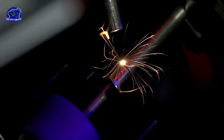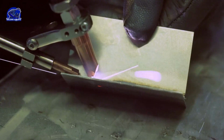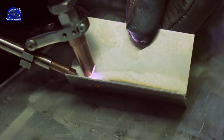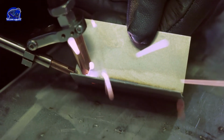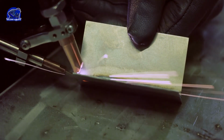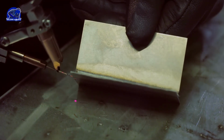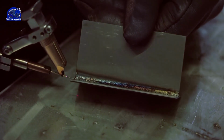Wrapping up, generally, laser welders are employed in applications where high production is the main concern, as they are fast and produce high weld footages per hour. They also produce clean, aesthetically pleasing, and strong welds with a small HAZ. Since laser welders introduce less heat into the base metal, they are perfect for welding fragile parts and metallic foils.